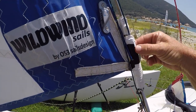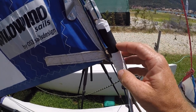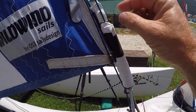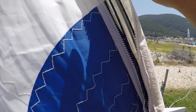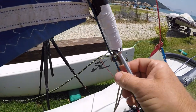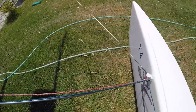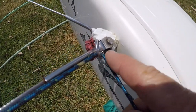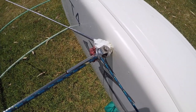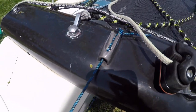The jib cunningham line is tied off underneath. We put a plastic protector on our jibs here just to stop any chance of damaging the spinnaker on any split rings or clevis pins. The jib cunningham line goes up inside the zip of the jib where on this particular one it just passes through an eye — no need for any blocks as there shouldn't be that much friction — and then down through an eye on the strut. You can put a pulley block there if you want. It is then led down to the bow tang fitting, passing through a stainless ring, and then back to a small block. One end is tied to the dolphin striker and the other is led to a cleat so we can adjust the jib tension while on the move.